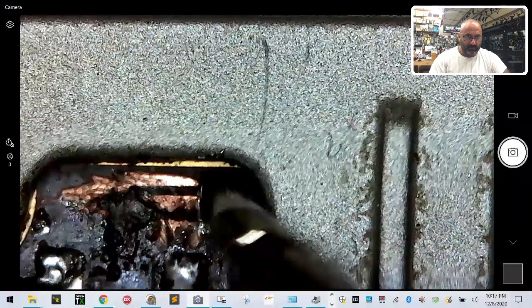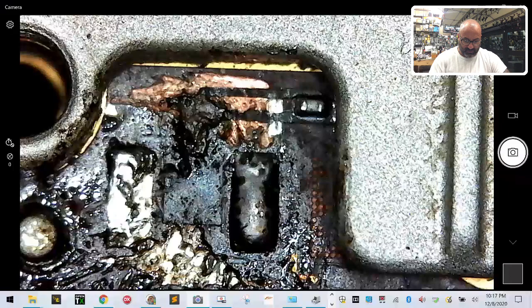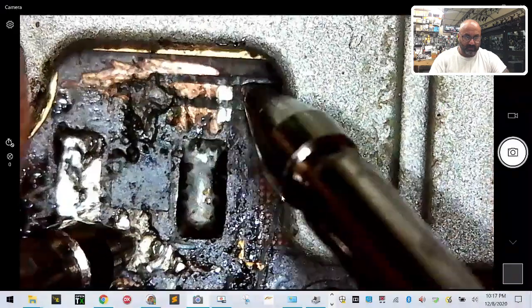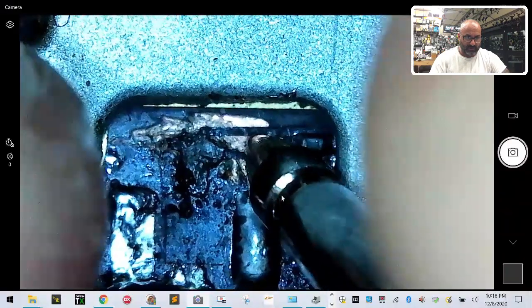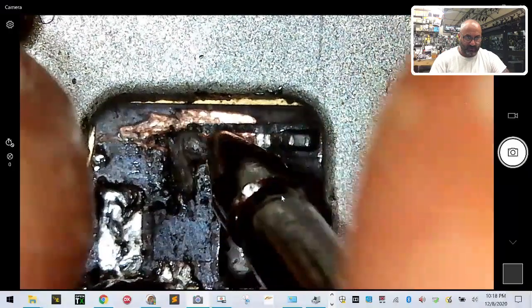So, if I'm not mistaken, and I believe it should be now too, right? So let me do a continuity test from this pad to here. Nope, here. Yep, here. Okay. So we have ground, but the middle one should not beep. And that is where the other piece goes. And what you can see here is that it's broken.